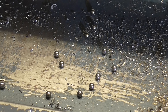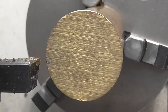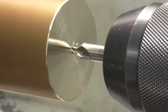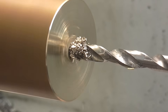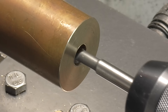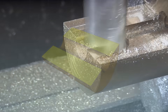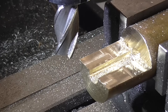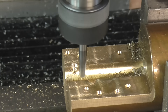So I thought I'd try a different way of making a nut for a ball screw. Everything looks normal so far — this is how I'd usually go about making a nut. But instead of screw cutting the threads with a turning tool, I'm going to take this bar and machine away exactly half of it. This gives me much better access to the inside. Then I can mill the threads on my CNC machine with a small ball-nosed end mill, which matches the diameter of the balls I'm going to use.